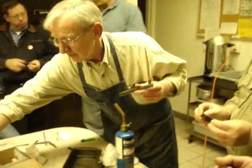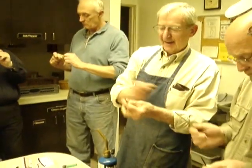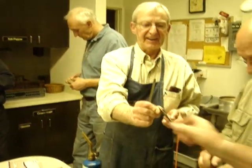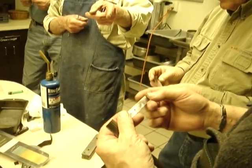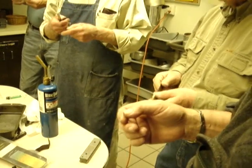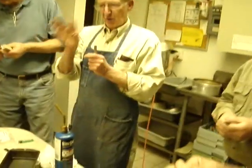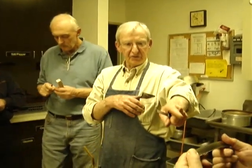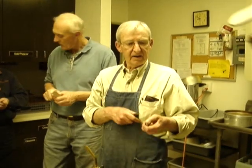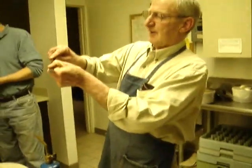They're not dead flat. These have been kind of abused. But if you heat treat them, you got something like that, that's still borderline usable, even though it's warped. It's borderline usable for a short blade knife. And you can take some of that out when you grind them. Some of these are bowed to begin with. But you cut this in half for a 3-inch piece, it's relatively flat. It has a slight bow to it, but it's not bad.